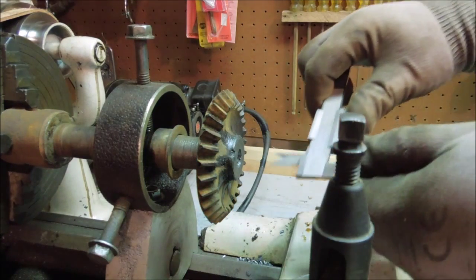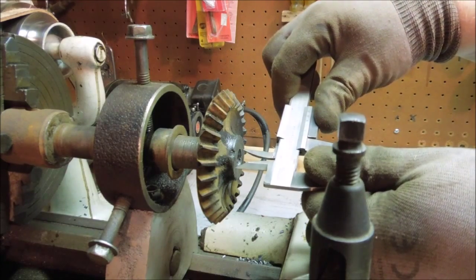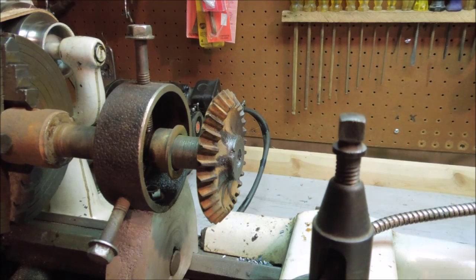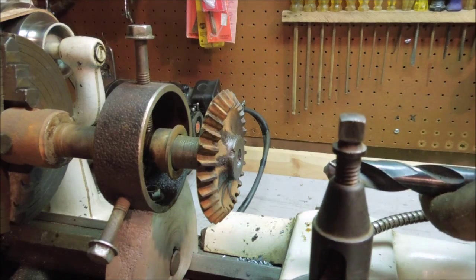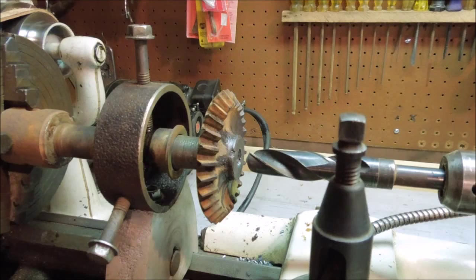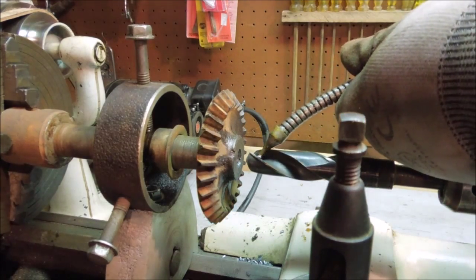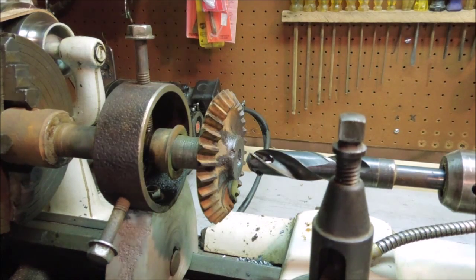If it hadn't been 3 days since I did this, I probably would remember this number, but I'm going to double check it anyways. That comes out to 825. Well, 3/4 comes out to 750, so I think we're pretty close. Close enough I can leave it like that. That means I want to put the 3/4 inch drill bit in there. Leave me about 50 thousandths under, which should put me well into that key. And I'm going to go lower on the speed still.